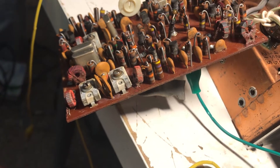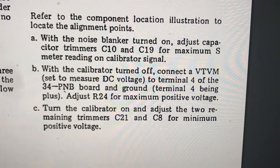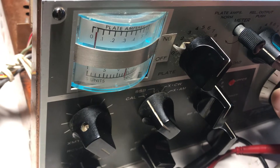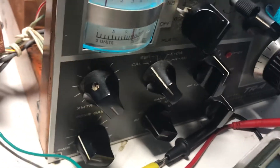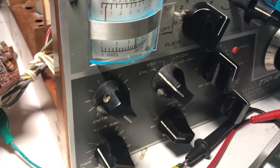I have a tune-up procedure on my computer screen. What they're saying to do is turn it on and adjust capacitors C10 and C19 for maximum signal on a calibrated signal. Those two — C10 and C19 — are right there. I've already done this, but I'm simply going to redo it for the sake of the video, showing people how to adjust an NB34 noise blanker.